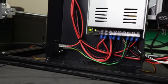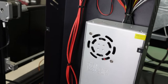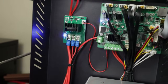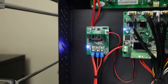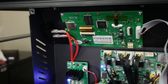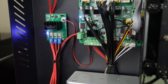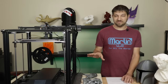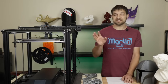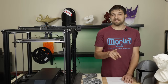The electronics in this printer are not the same as what you'd find in the regular Ender 5 or Ender 5 Pro. The electronics here are similar to the CR-10. It has a dual Z screw main board with A4988 drivers — a very loud main board, as you heard in the original preview video. You're not going to want this in a living space where you'll have to listen to it.